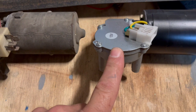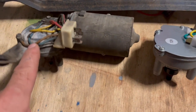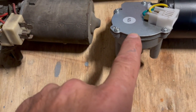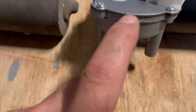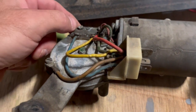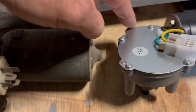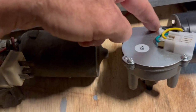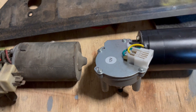The first thing I'm going to do — there are two ways I could do it. I can cut this off and weld it to this section here, or I can get a bit of two-and-a-half mil plate, which seems to be similar, and make something. Trace this out, make this to fit over the top with the extension on, and just screw it straight down and notch out around all this stuff.